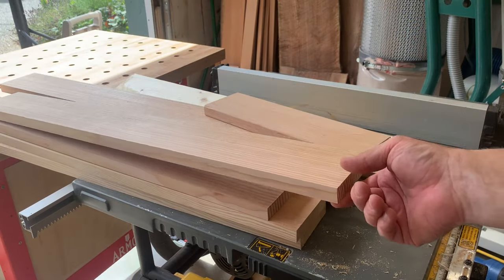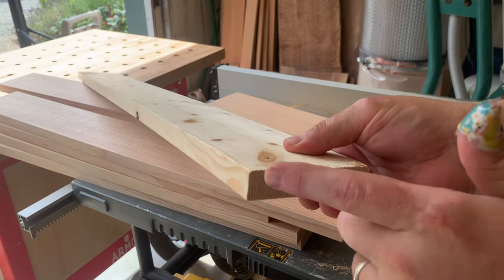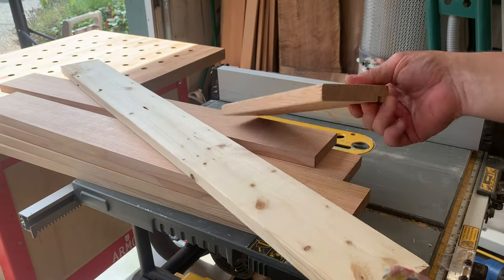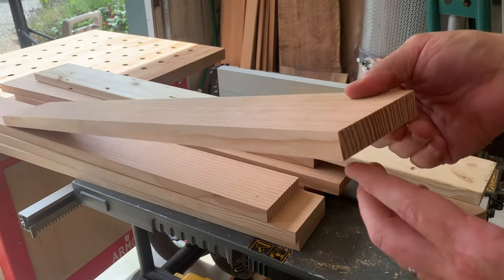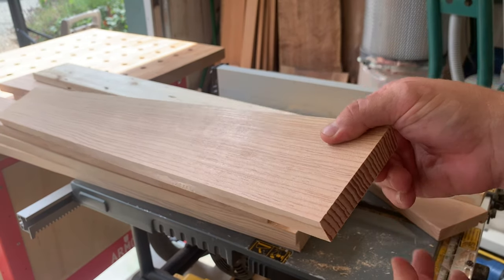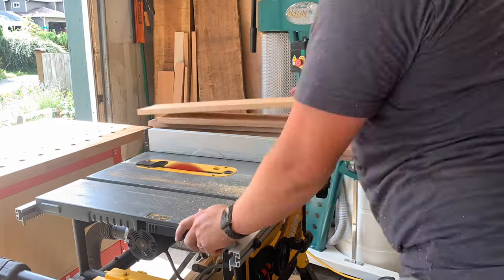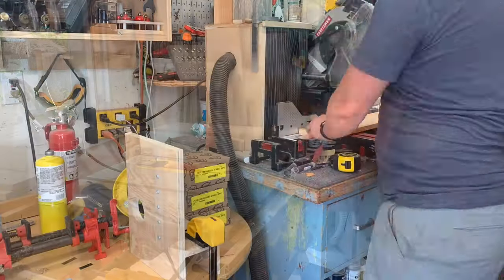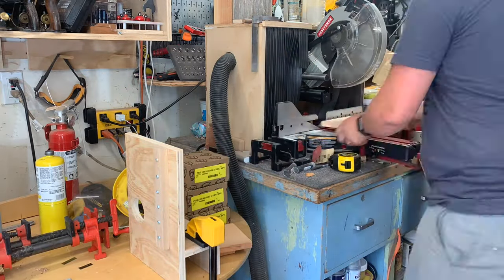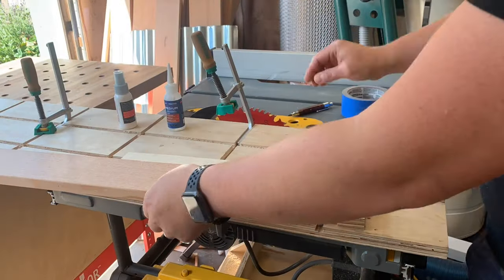For the table base, I went with some three-quarter inch fir. You could also use some pine - just if you're going to use any of those pre-surfaced woods that you can find, they're going to have those rounded corners, so you're going to need to trim those off to get it nice and square. But you could use any wood for this - you could mill up some rough lumber too, whatever wood suits your fancy. Here I'm just ripping these down to about three and a half inches wide for the legs. Knocking off those rounded corners, get it nice and square, and then using a stop at the miter station to cut my legs to uniform length.